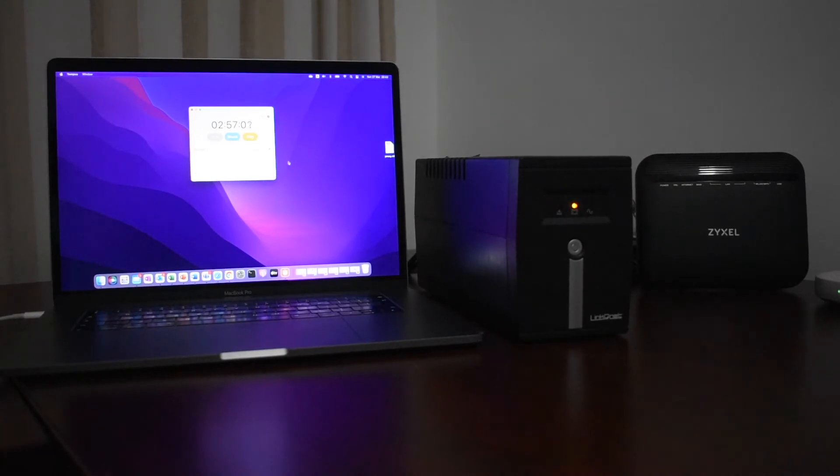The UPS is coming up on three hours — three minutes short. It would have lasted three hours without any problems. There you have it: two hours and 58 minutes for the UPS with the lithium-ion iron phosphate battery in it. I'm also not going to let it run down completely — it should be at about 90% now.